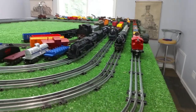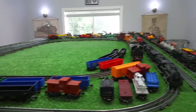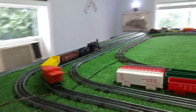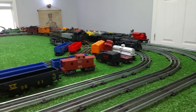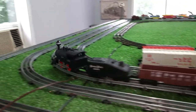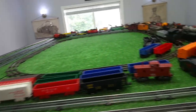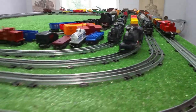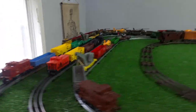This little locomotive looks absolutely new, pulling four cars with no problem at all at 50% power on a 90-watt transformer. I could probably put six, maybe eight cars behind this and it would still have plenty of power. Let's see how slow we can run it. As you see, it runs absolutely perfectly on AC just by adding a single diode.